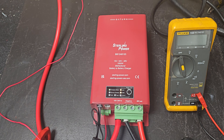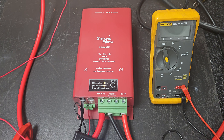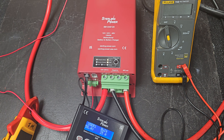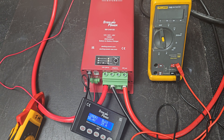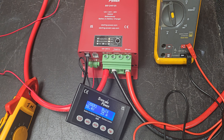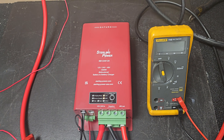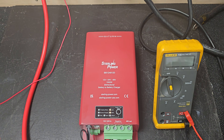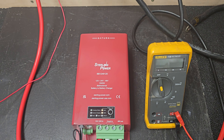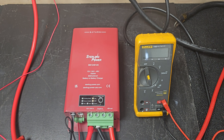And you do sacrifice a bit of power performance. As I've said, this is about 1,500 watts output. You will be down at around 1,300 or so watts if that output voltage is dropped a bit. You'll still be getting your 26 amps, but of course the voltage will be at about 54 volts rather than 58, 59 volts. So the answer is this will do it — you'll have slightly lower charge wattage, but it will certainly be able to perform the task.